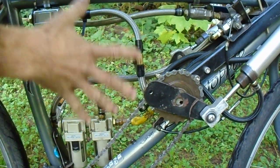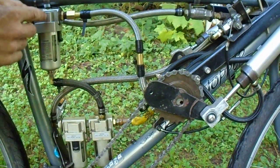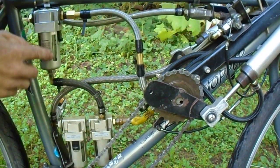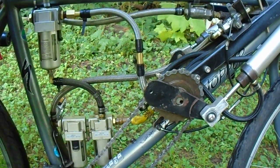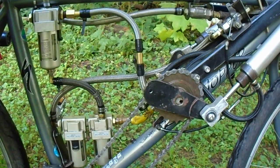So whenever there's no pressure in the system, the automatic release allows the air to escape and the moisture or lubrication that's up in here can go back down into the lubricator down there. So it's a totally cycling system at that point.